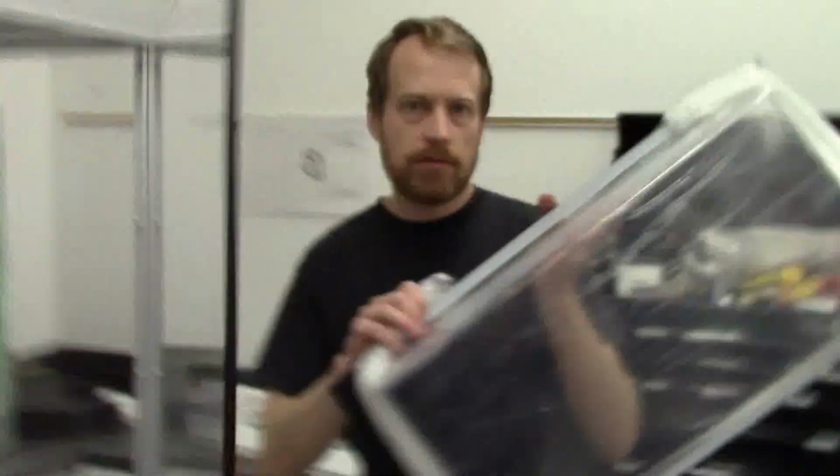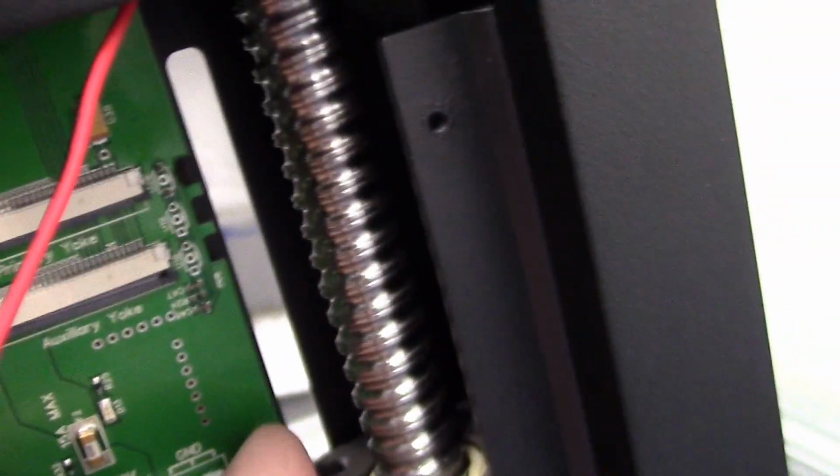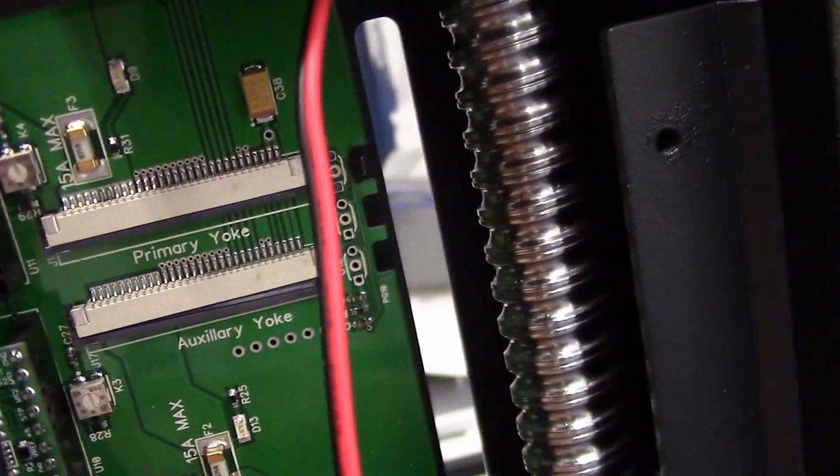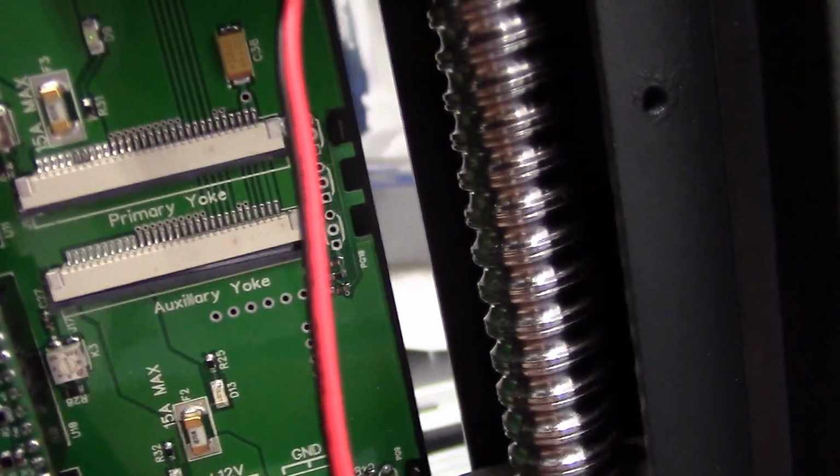While you unpackage that, I'll see if I can show that pretty quick. So what we're talking about, oh, this one doesn't have a bed. Well, anyway, there'll be a little piece that sticks out from the back of your table arm, and it's going to slide into that hole. Now, if this is rotated a little bit, it might just rest on top, so you might want to make sure that it's actually seated in that hole. Otherwise, you'll get a little quarter-of-an-inch surprise later on while you print.